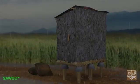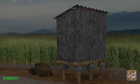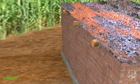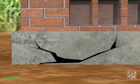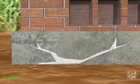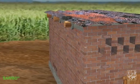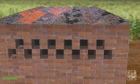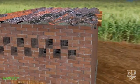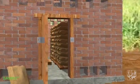The walls also need to provide protection against water and some sort of secure closure to keep the grain safe. On larger storage buildings, it is important to conduct seasonal inspections and repairs of roof and walls. This will prevent any moisture from getting inside the building. Install metal screens on ventilation orifices that allow air to circulate freely, but keep insects and rodents away. The entrance door should also provide a solid and secure closure.